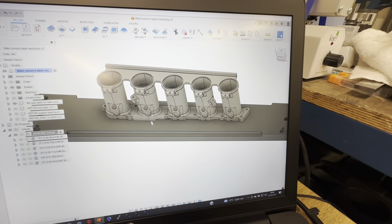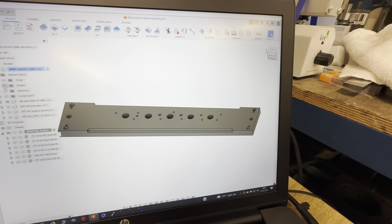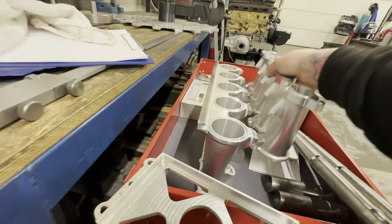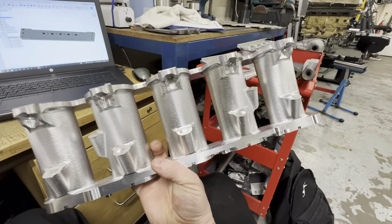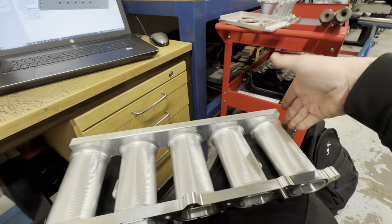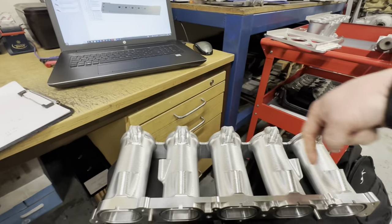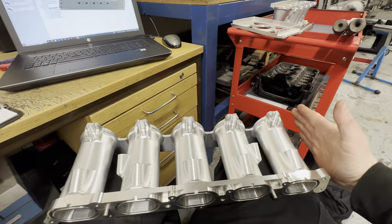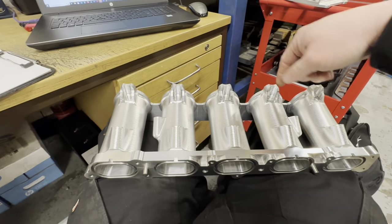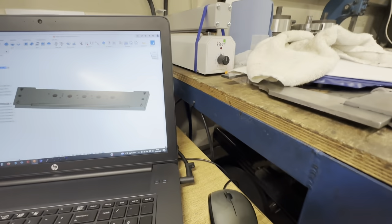I'm still modelling it as the longer 800mm table, but I'm actually going back to the short table — I think it's 600mm — because we've done all the parallel tool paths, all the flanges and sides. We don't actually need big spaces to come around on the tool. Everything's going to be worked across this area, so we're not really going outside this boundary, bar a bit of lead-in and lead-out with a face mill. We've gone back to using the little table because it's just going to be a little bit easier.